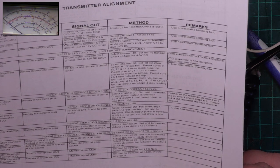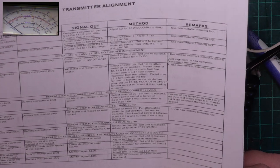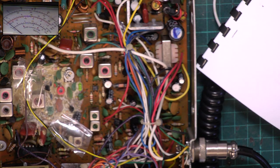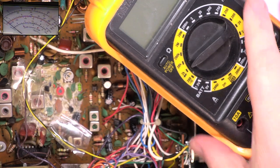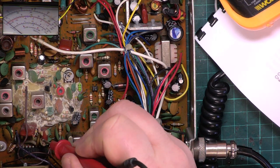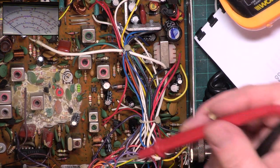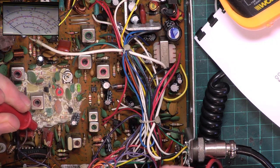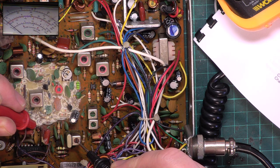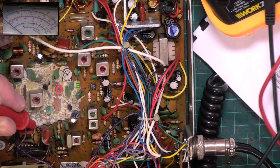So, yes, it's capacitor 9, and what channel are we on? They have you start with channel 1 on the Amstrads. Most other set makers have you go the other way around. So bring that meter back. Now, capacitor 9 is this one here, and the far side is the test point. So we have to get the prod onto that pin. So you've got this Mylar capacitor, you've got the crystal reference coil trimmer there, you've got the reference crystal, you've got the phase lock loop chip. See if I can move the camera down a fraction.